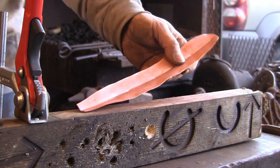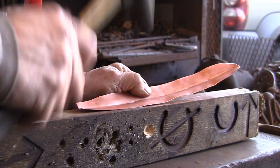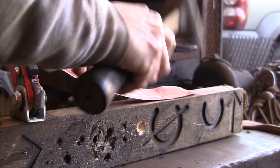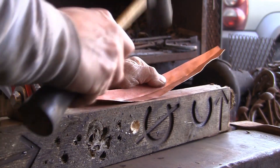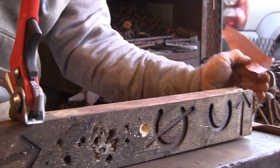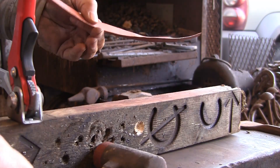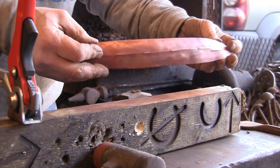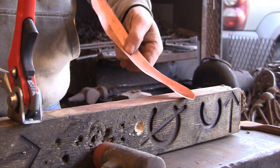I'm going to use the rubber mallet again — I want to put some shape into these leaves, sort of not semi-circular but with a good bit of shape in them. I'm just going to beat this round into the wood. If you try to bend it by hand into a semi-circle it'll just crease, so you really need to beat it round. There's probably an easier way — a sandbag perhaps — but you've got to keep beating it until they come round to your desired shape.